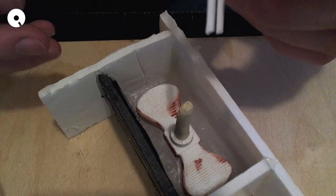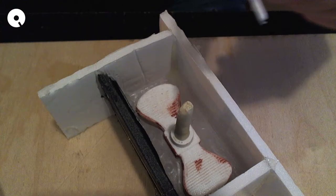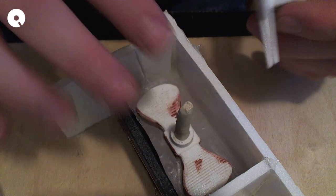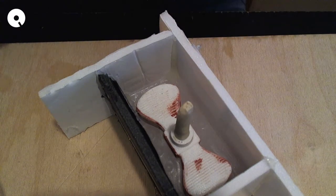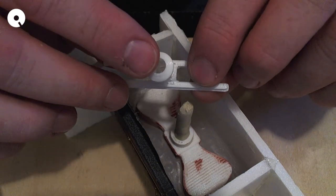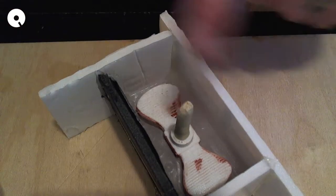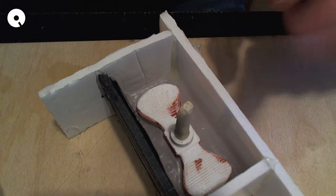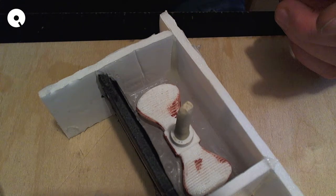because once I put it in and then pour the material into the mold, I want this to be well embedded and held securely, and with the sleeve holding it, it means there won't be any air gaps so that the material will leach out. I'll also need to plug the hole here when I'm pouring so that it doesn't come out the end. So that's the explanation for this little clay piece here. I'm going to work on pouring the mold, which again you don't need to see, so I just wanted you to see this part because I thought it'd be interesting.